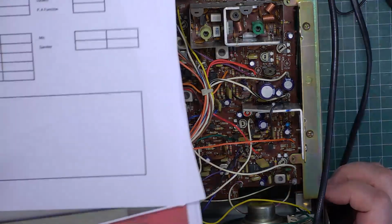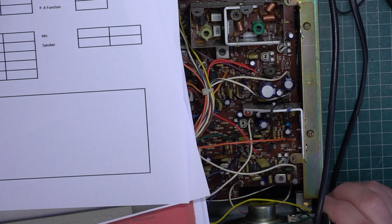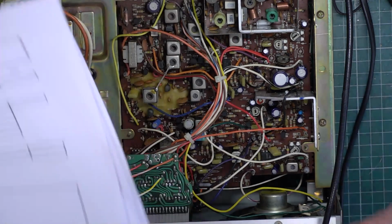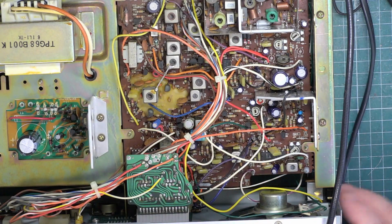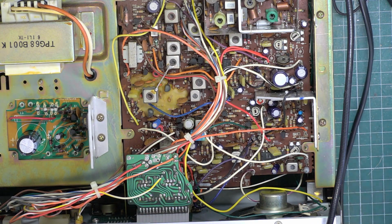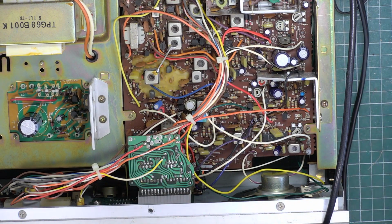And unlike the Harvard, which I can't continue with at the moment because I need an on and off switch, 22mm spacing between centres, double pole switch. Can I spot one? No. Right, same one was used on Marantz stereos, and you know what, there's greedy people out there who want 50 quid for a switch.